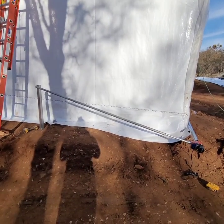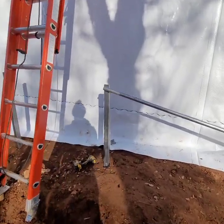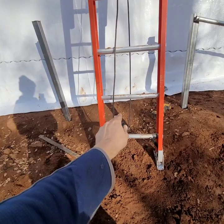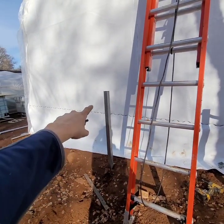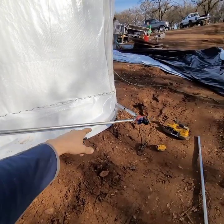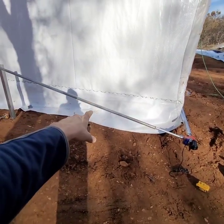That is what a complete pivot point — I like to call them telescoping arms. Find the center of your greenhouse, measure 16 to 18 inches out. Measure two feet one way, two feet the other — so four foot distance. Cut your tops off. You can see this side is cut — I put a bolt through to pivot. This is a 1.3-inch diameter steel and this is a 1-inch piece of EMT. For smaller greenhouses I like to use the EMT. For bigger greenhouses I use the inch and five-eighths with the 1.3 as the smaller piece.